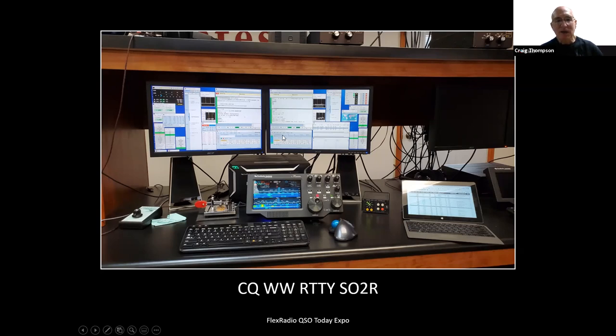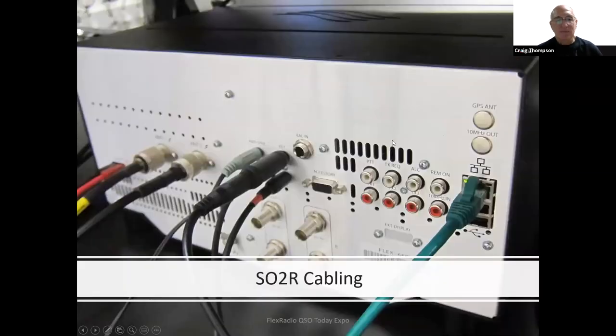I try to keep my hands on the keyboard or mouse and my eyes on the screen while doing a contest, and I've been very successful with this setup. In the upper left-hand corner is the PGXL utility. Because I'm in a RTTY contest, I'm not wearing headphones — I'm just listening to speakers at very low level so I can tell there are RTTY signals. I moved the PGXL behind the station to keep the noise away from my ears. This is how simple SO2R wiring is for a Flex 6600 — you only have to move one antenna cable and change N1MM from single radio to two radios, and you're done. That's SO2R with Flex — simplicity.